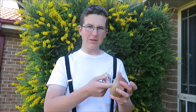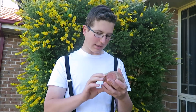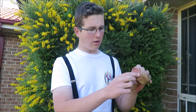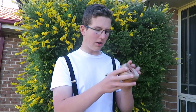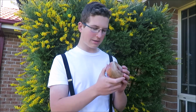I didn't hollow out too much because it's quite shallow and I didn't want to go through the bottom. And it gets quite hard to get towards the sides of the hollow form, especially when you're turning side grain. But I quite like the look of the rings here and the dark red timber. I think that looks nice. And the wax finish seems to work nicely with this timber. And the contrast of the sapwood with the heartwood is quite nice.